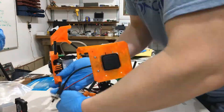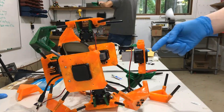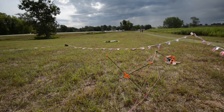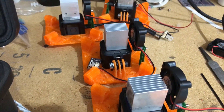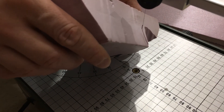We held everything together with an adhesive called Loctite 410. I wasn't sure whether it would survive the flight or break apart into a million pieces, so we made sure to attach all the GoPros together using fishing line, and each payload was combined together using paracord. We were worried about thermal management — on the ground the cameras get really hot, and at higher altitudes it's too cold for the batteries. The batteries had to be wrapped in mylar with heat packs, the cameras needed heat sinks and fans for lower altitudes, and we considered putting foam on the outside of the GoPro rig to keep them warm at higher altitudes.